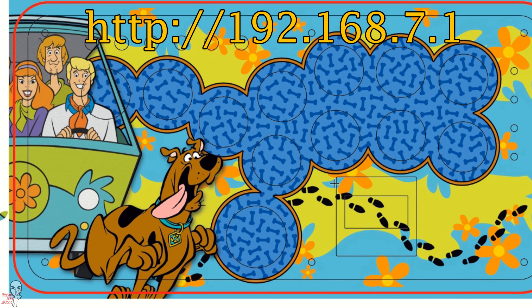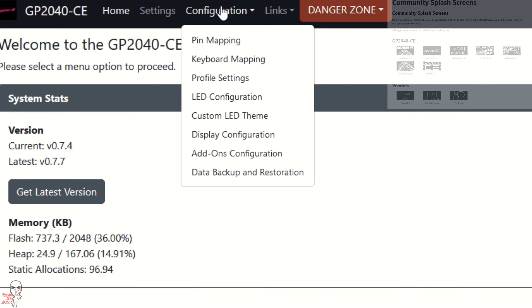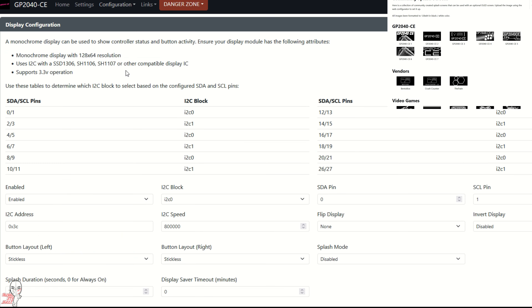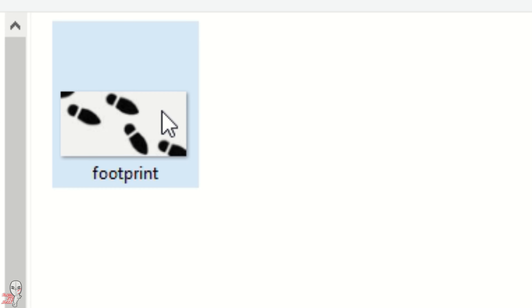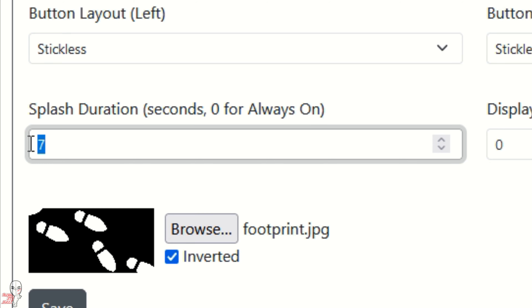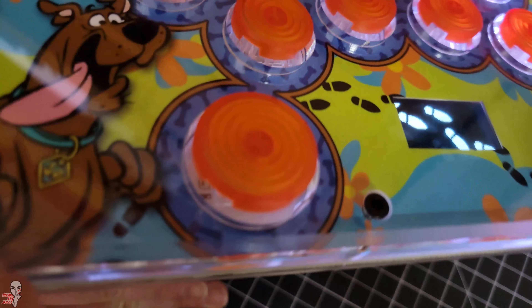The screen is a monochrome display with 128x64 resolution. We can utilize pre-existing options or create our own. Here I'm going to change the screen to follow these footprints already on the art. You can also invert the colors after the fact with the configurator tool. Then I'm going to set a timer — say 25 seconds — before it defaults back to the inputs, and then make sure the splash screen is toggled to enabled. Save and exit and we should have a cool little screen that fits well with our Scooby aesthetic.